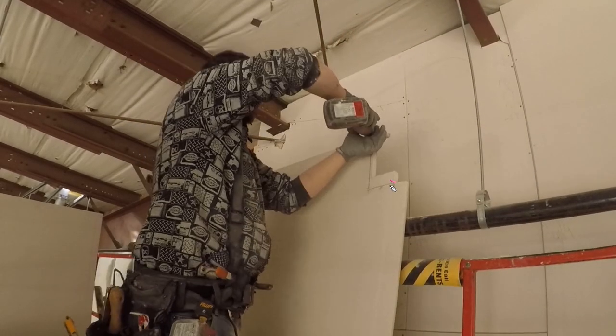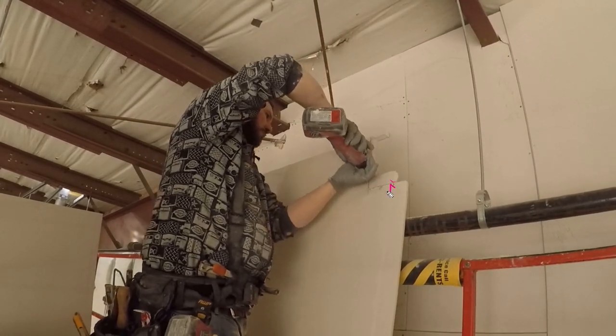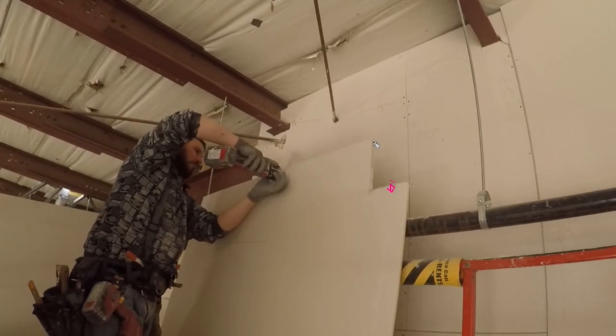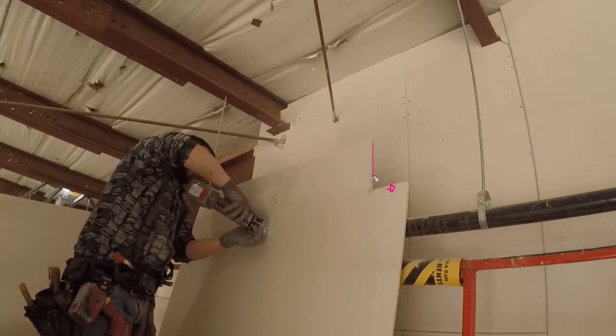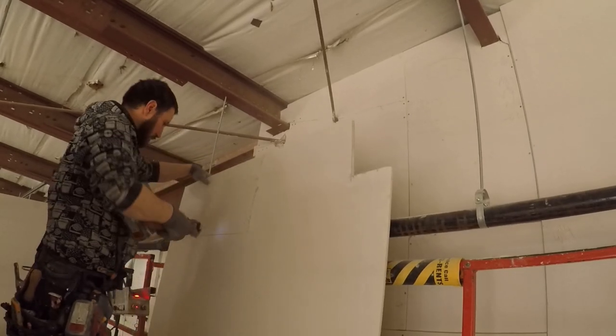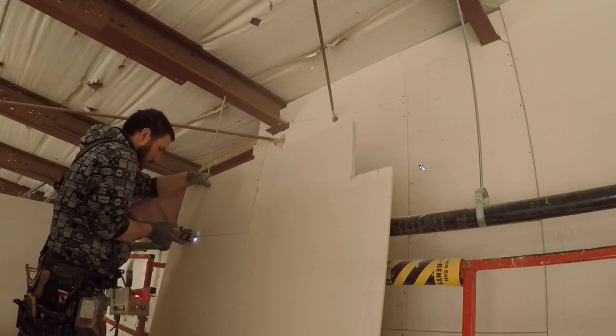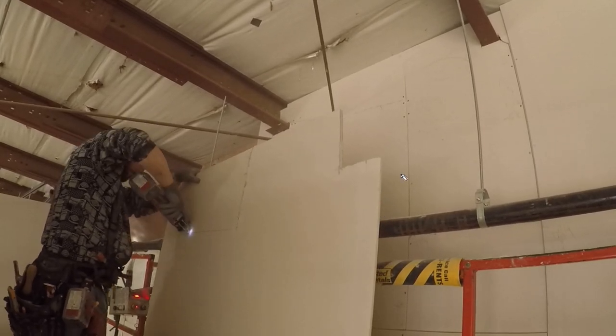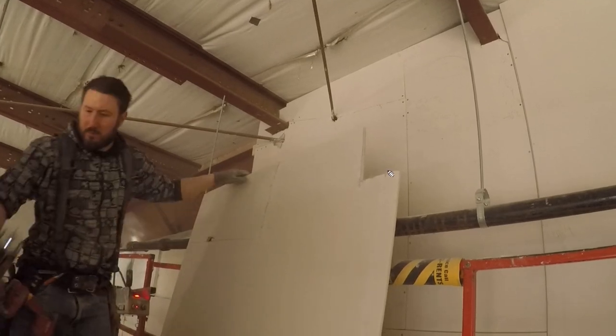When you're cutting your tops out, hold the router on an angle towards the outside, the back of the cuts, away from the line. Hold it on a little bit of an angle away from the line, and you'll have a little bit of extra playroom when you're putting your tops in. Not a huge angle, but put it on just a slight angle when you're cutting there.